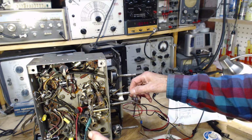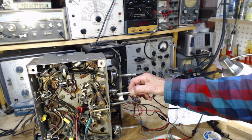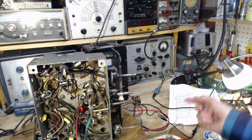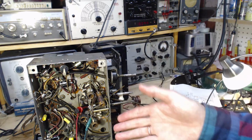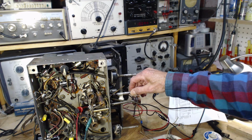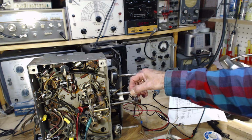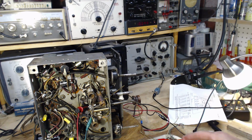Okay, so that's what the radio's doing with 1/100th of the signal the other band was trying to work with. And it's about the same, right? It's better. Okay, that's now 1,000th of the other signal, or 10 microvolts, roughly. Now that's pretty good for a radio like this. See, either the mixer or the detector is adding in a lot of noise as you tune in. I think that's where all the hiss is coming from. But that's not bad, because that's a very weak signal.